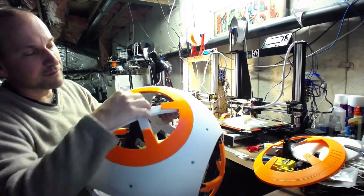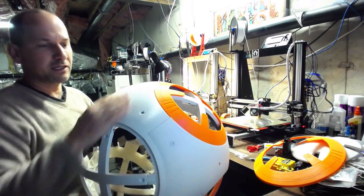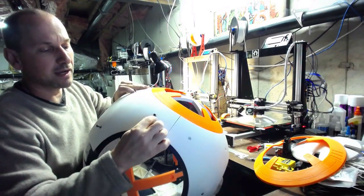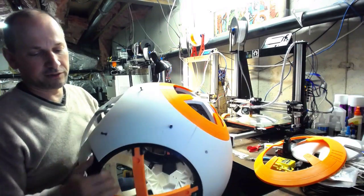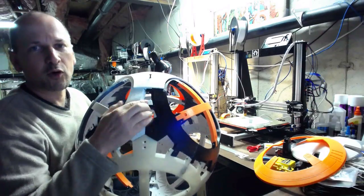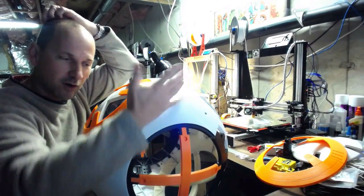Here's one over here — I don't have the center in yet, I'm still in the process. Things are printing; some are done. They just lock in, and this section is actually not even glued — it's held in by the panels. Carrie also designed the panels based on the club design, but remade them to have inset screw holes. There are little inserts — aluminum or stainless steel — and low-profile M4 bolts go in there to hold things together so you can take them on and off.